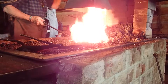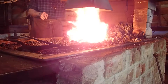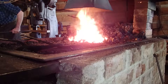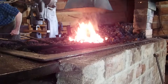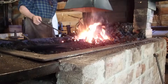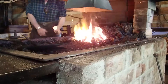As mentioned earlier in this video, blacksmiths like low sulfur coal. Sulfur out in the environment is mostly found as the element SO4, or sulfate, meaning with every sulfur molecule there is some oxygen nearby. If you remember, fires need heat, an ignition source, a fuel, and oxygen. So if you use high sulfur coal, little extra bits of oxygen are added to the forge from that sulfur as it burns. This makes the fire get hotter and then colder, hotter and then colder. So the blacksmith uses low sulfur coal so that it has a nice, steady temperature in his forge fire.